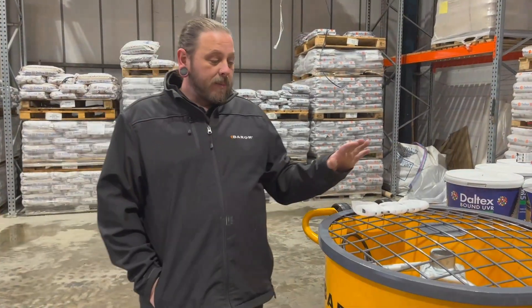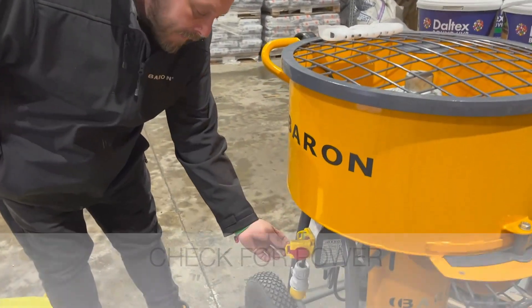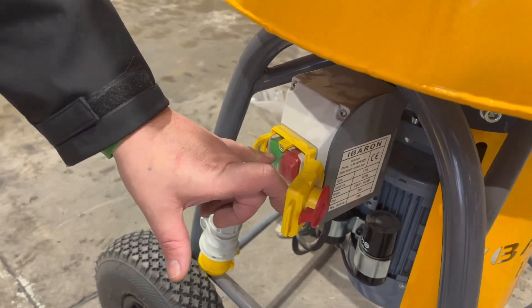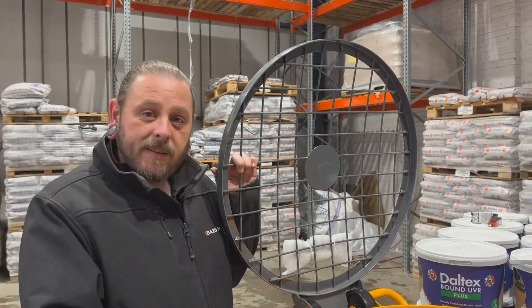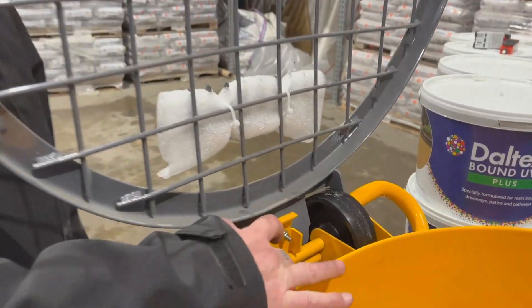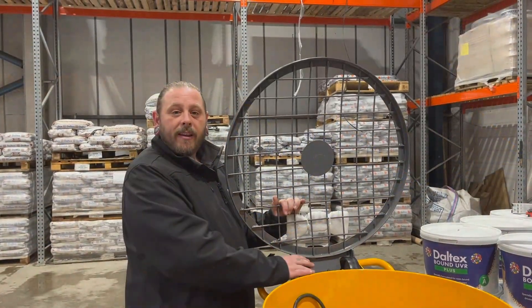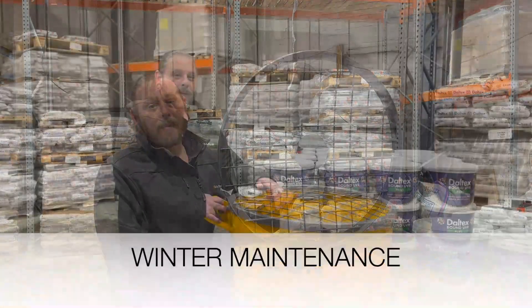If you're on site and you find your mixer has failed for any reason, the first thing to check is that it's receiving power. A good way to do that is to try and engage the mixer with the green button. If it returns freely, there's no power going to the machine. If you're getting no resistance from your main switch, then the next part to check would be your lid switch. When you have power connected and depress the button, you'll hear the motor receive power. If you find that neither of these have failed, then please contact us to speak to the technical department.